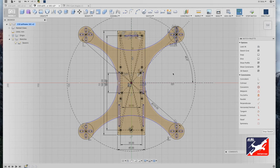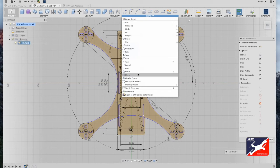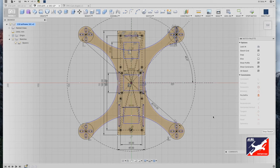Next, reduce mass by cutting additional holes into the top plate — you can use any number of shapes, write your name, or add a logo. To keep it simple, go to sketch menu, use the center rectangle tool, and in the front of the aircraft where the center construction line meets the arc, drag out and type 25 by 25 millimeters. Right-select the square, sketch menu rectangular pattern tool, use the vertical handle, enter a distance of minus 100 with a quantity of 3, and hit OK.